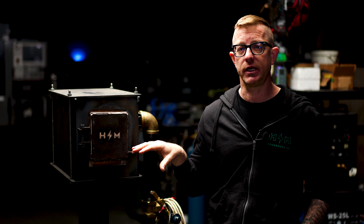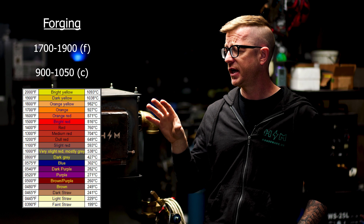I forge weld at 4 PSI — 4 to 5 PSI, 5 at max. I'm going to show you how I tune this machine to do that work using my ears and my eyes, not a PID controller, not a thermocouple, not an infrared controller.